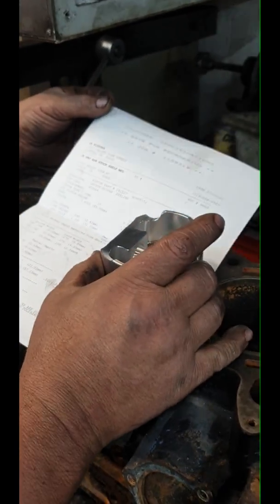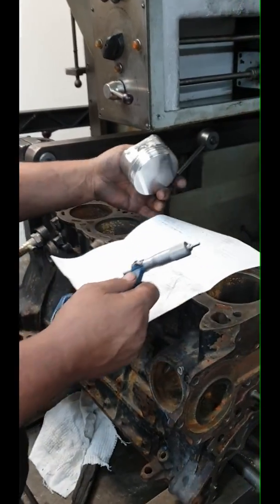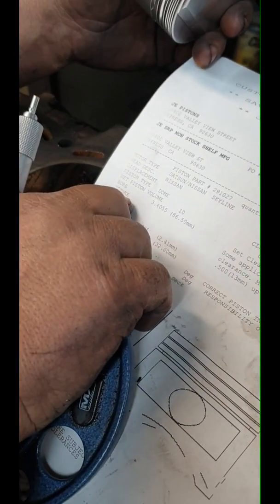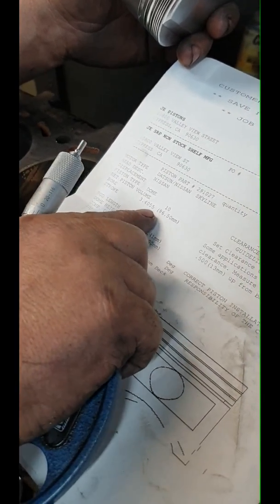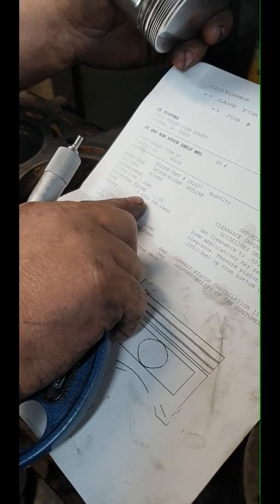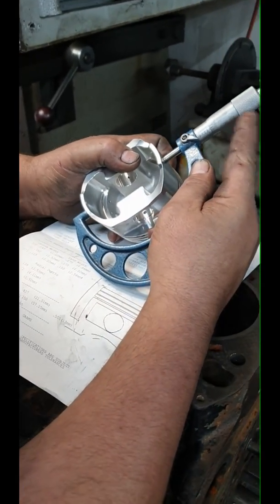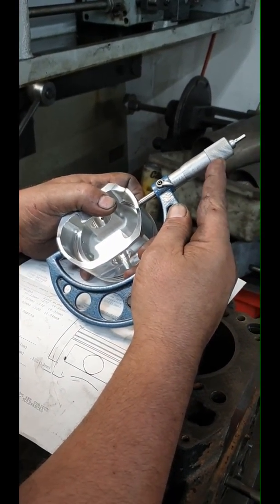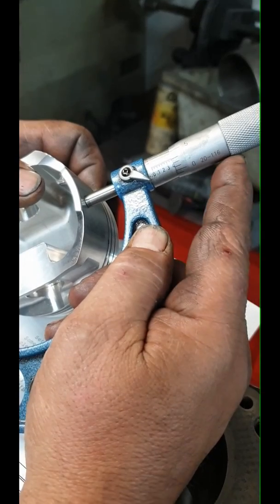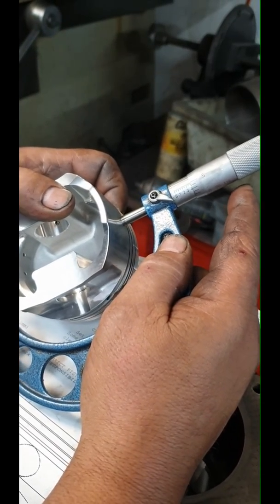Here's the information on what to do. We're going to measure it first to see what it is. My finished bore size — standard bore is 86 mil. So this is a half mil oversized piston, 86 and a half mil. In Imperial that's 3 inch, 405 and a half thou. Look at the clearance on this very noisy piston — we've got three and a half thou clearance.